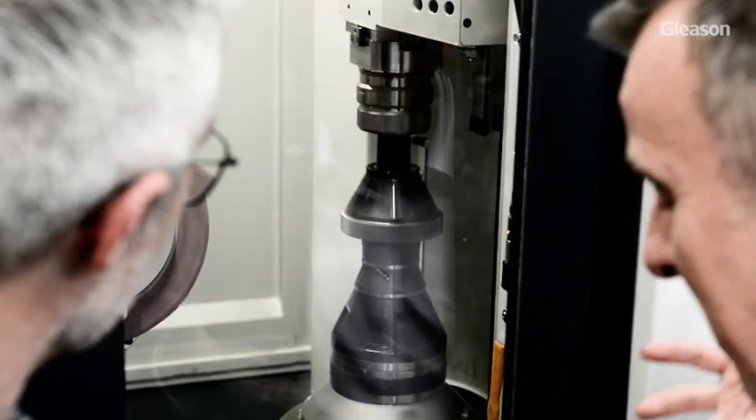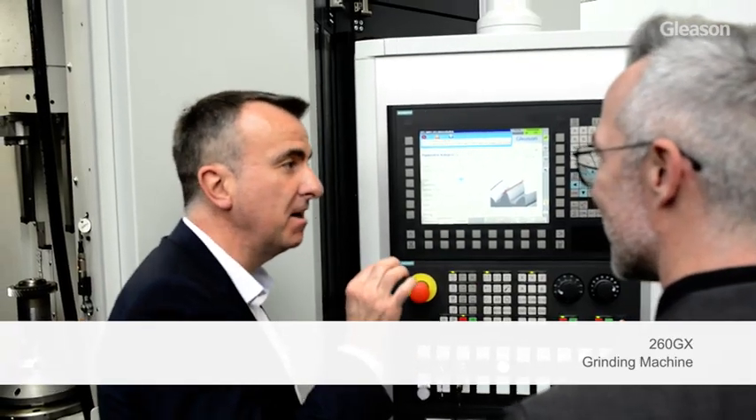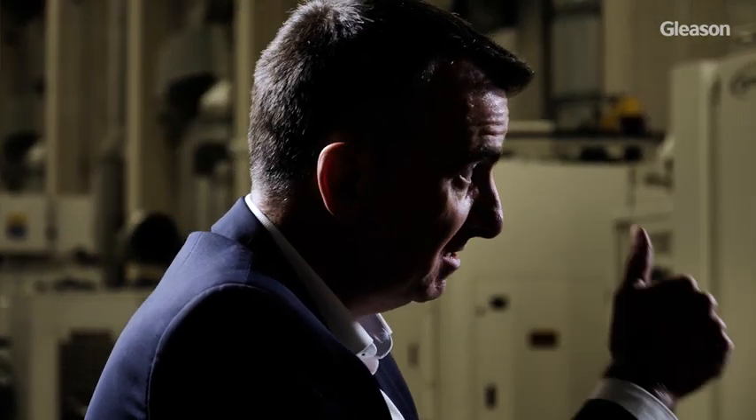That is the problem with this so-called natural twist, which appears in all grinding processes. Gleason understood this problem pretty early and we developed sophisticated methods — by the way, for both profile grinding and thread grinding — to produce any amount of twist, no twist, or a dedicated amount of twist. Gear designers nowadays are even requesting a specific twist for more and more gears. Our method applied on Gleason machines does not affect cycle time and it does not affect dressing time, which is very important. Whether you do twist control grinding or not, you have no impact on cycle time, and hence you are not really affecting cost — which is a big differentiator from other methods available in the market.